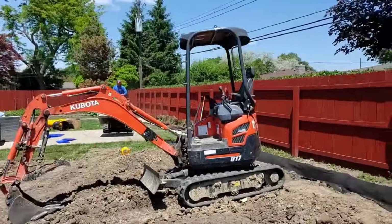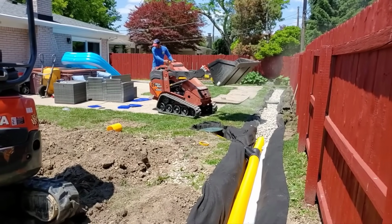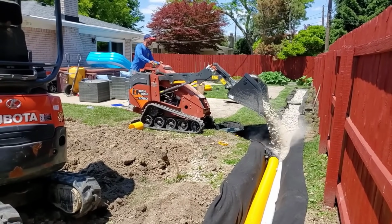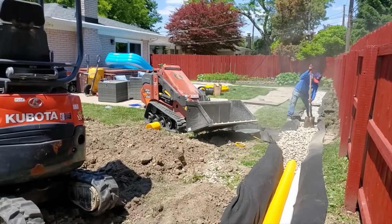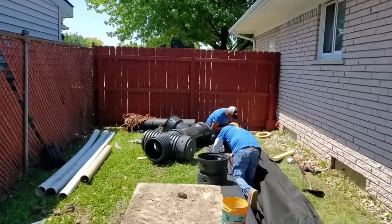It actually gets caught in those inlets, and that's where the problem lies. So that's where the sleeve or the sock shines. This is the only place that we use a sleeve or a sock, when we're dealing with stone that's fragmented, whether it's a crushed stone with little pieces of crushed stone, or crushed cobble mixed into the cobble.